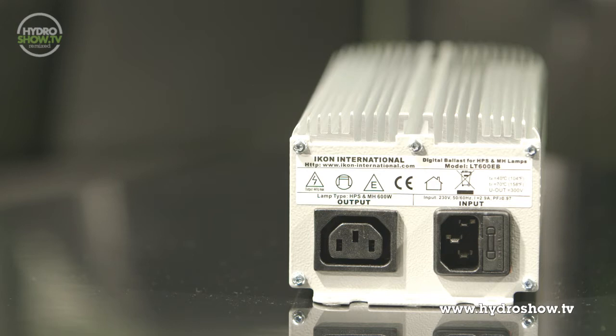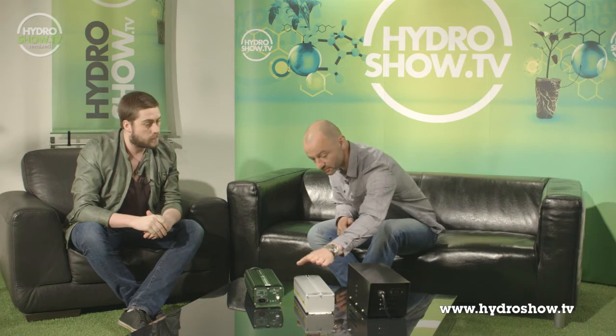So in the middle here we have a silver digital ballast. Would you say this is one of the first generations of digital ballasts after the magnetic one? Yes, indeed — a digital ballast that superseded the magnetics. In terms of efficiency, it's able to strike the lamps and bring them up to full speed within three to five minutes, as opposed to the 20 minutes a magnetic ballast might take. Quite a saving. With this ballast we obviously have more efficiency, better lumen output, and quieter operation.